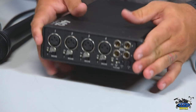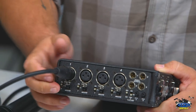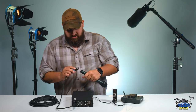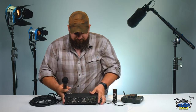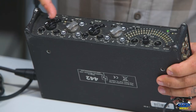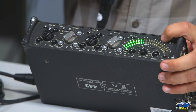On the side of this mixer you'll notice four XLR female ports. Go ahead and take the male end of the XLR and plug it into the back of the mixer. You'll see options for phantom, mic, and other power settings — this mic needs to be set to mic and phantom power. Once you have that set and you're plugged in, connect the other end of the XLR into the mic. Spin the mixer around and you'll see there are no levels yet, because the fader for that channel needs to come up.